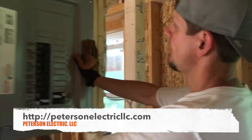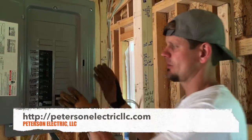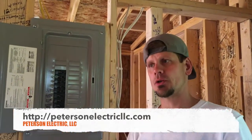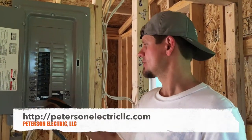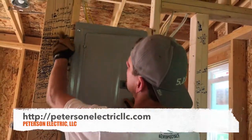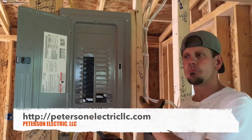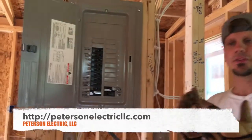In a nutshell, we ran a panel up to here. The customer preferred it to be all downstairs, but I talked him into it — it's better to have this panel up here for two reasons. One, let's say the owner has a panel in the garage and the tenant didn't rent that area and they have a breaker trip and the owner is out of town — they can't reset it, especially if it's an arc fault that tripped on a treadmill. The other thing is that to run all 12 circuits in this panel all the way downstairs through the wood would have been really difficult. Better to bring up just a quick sub-feed — number 2 aluminum, 100-amp panel, breaker it downstairs. You don't have to have a breaker up here; it's a main lug. The breaker is down there being serviced with that tie tag.